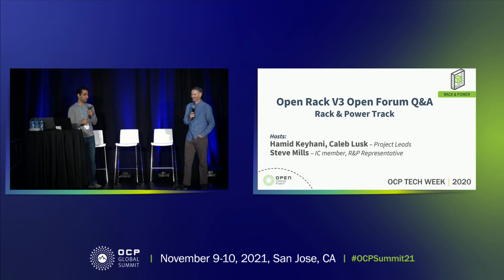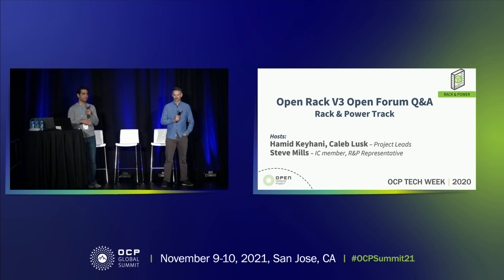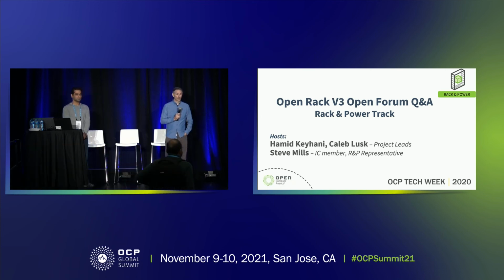I think we try to do all of that to accommodate any new design and modularity in the solution and the rack and the power. So this architecture will stick here for a while. I believe the feedback that I keep hearing, even today, is can we go higher and higher? We can definitely do that in V3. We don't need to go to a new architecture. Yep, there's definitely a lot of flexibility in the design of the bus bar to incorporate more power. So hopefully that'll give the community enough flexibility to provide some legs for V3 to last quite a while.